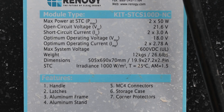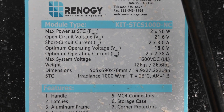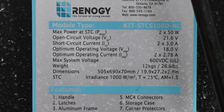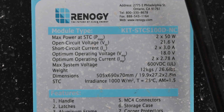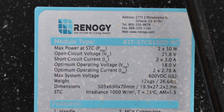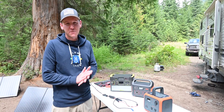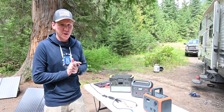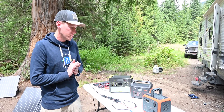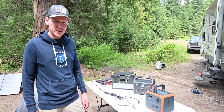I haven't seen any power station that can't handle at least a single 100 watt panel and its voltage, so just know that a 100 watt panel will be fine. Based on what I've seen, the only time you have to worry about this is when you're going to connect several panels in series, and most of the time you don't have to do that even if you want to combine several panels. So we've got the panel, the adapter, we've made the connection, and we know these power stations can handle it — let's plug them in and see how they do.